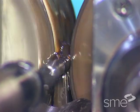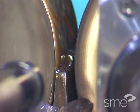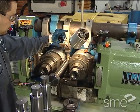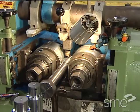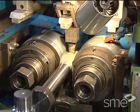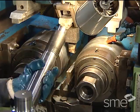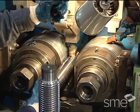Radial or cylindrical die rolling machines are capable of generating threads on larger diameter workpieces than with flat plate rolling. In cylindrical thread rolling, threads are produced by an infeed process. Two or three circular dies are fed against a workpiece forming the desired thread. Machines using two dies for radial thread rolling can apply greater pressure to the workpiece than three die machines, since they can use large diameter dies regardless of work diameter.